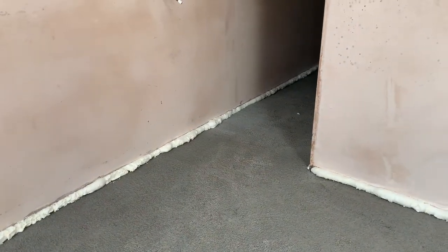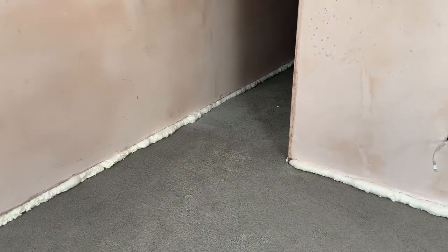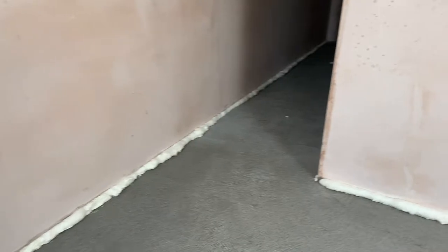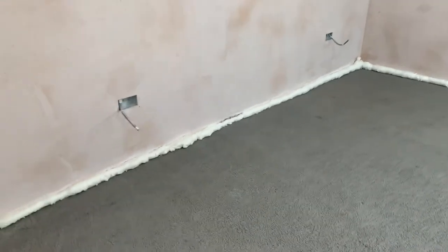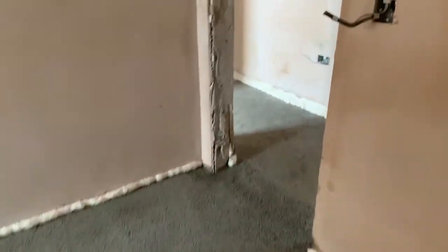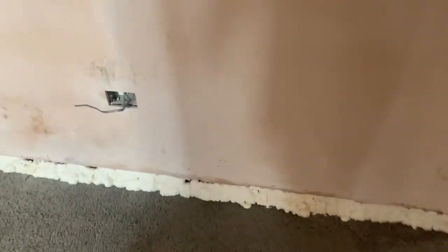So this took approximately 34 of the cans to do the whole house. It's about 300 linear meters of foam, and that's split between some quite shallow areas where it's just a 12.5 mil plasterboard connected onto the walls, a 50 mil board like we have on this wall, 50 mil over here, 50 mil, and then in the old part of the house, any of the external walls, for example in the bathroom area here, that is 100 mil depth in there. So there's 100 mil coverage there, and then obviously some of the plasterboard is down a little bit further than others, so averaged out, we've done quite well there